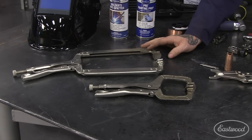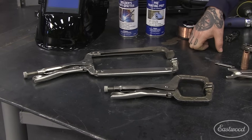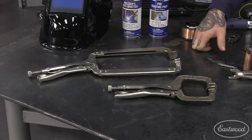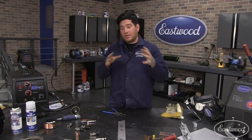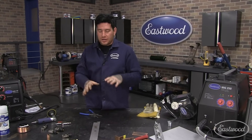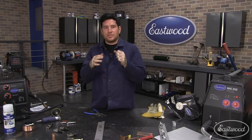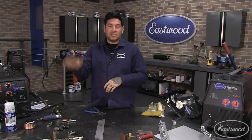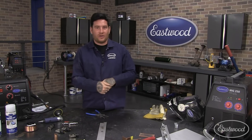These locking panel clamps are really handy - we offer them in a bunch of different sizes, and these two are my favorites. They're great for clamping a panel in place when doing something large like a quarter panel patch, checking your progress, making sure it fits correctly, or getting panels parallel and flush. They bridge a few pieces and clamp them together with great holding power. An old saying: you can never have too many clamps when working on an old car.